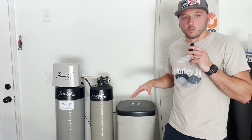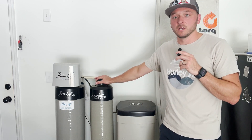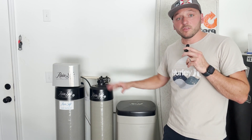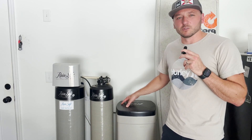We've always known since we moved in that the water quality in this area of St. Augustine isn't great. We went ahead and got this Rain Soft water treatment system installed proactively before we moved in - this is much more than a water softener, it's a full water treatment system. I hooked my RODI unit up to what I thought was treated water coming out of this, and come to find out it actually was not. I was ripping through the filters way faster than I thought. So I had the Rain Soft tech test my hose bibs on the side of the house, and the one I was using wasn't going through the system. I've since switched my RODI unit over to one of the hose bibs that is going through this system, hoping for some better results.